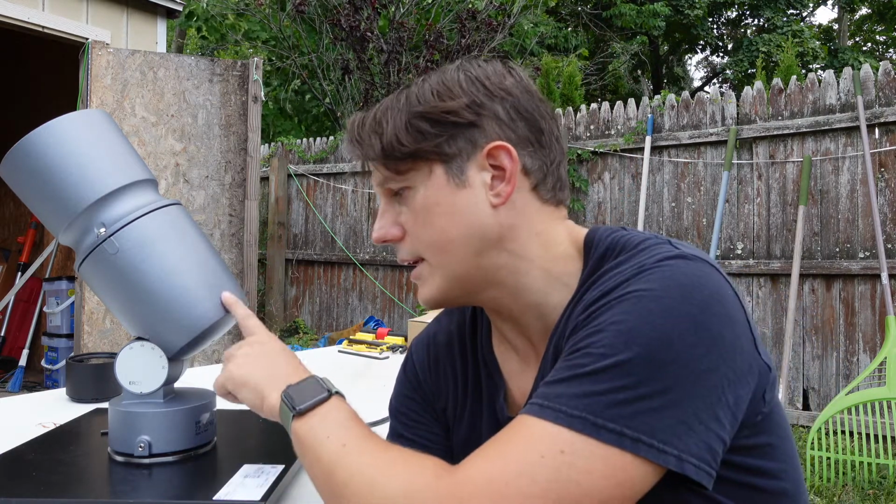It also means individual fixture control. So if you're lighting a sculpture or a statue or a piece of art outside and you want to subtly control different tones of light around that sculpture, you're no longer running multiple 0 to 10 volt runs or DMX to make that happen. Simple Casambi wireless controls can be built right into this thing. We are recommending a 50-foot gap between fixtures, no more than that, for wireless control. So for those kinds of really, really tight accent projects, you don't have to worry about controls.